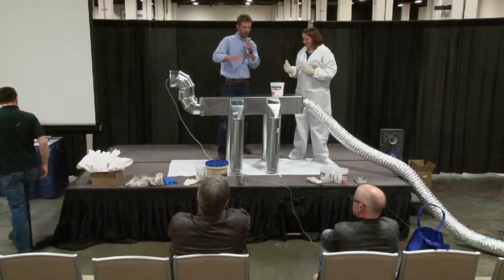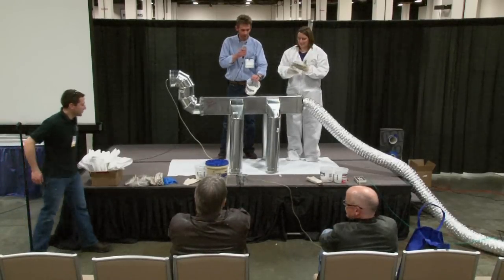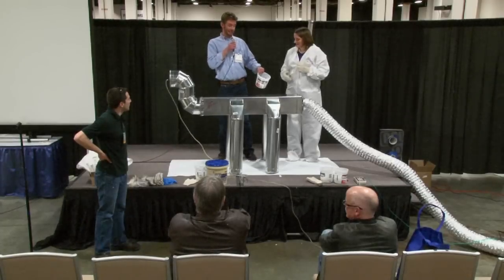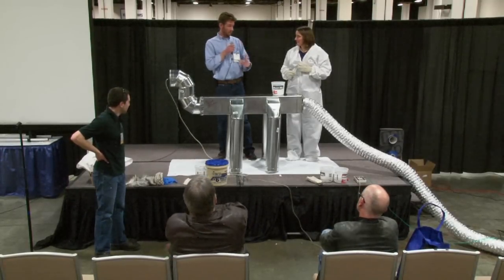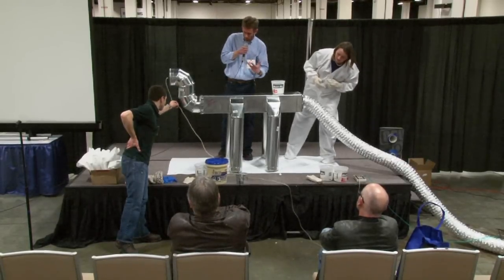The question was: why are we not using a paintbrush? This is a thicker grade — this is like a trowel-on grade. And when you have really leaky ductwork like we have here, that's what you're going to want to use. Typically the lower the number, the thinner. Typically number four is what you see — it's usually gray too — and they paint it on with a paintbrush.